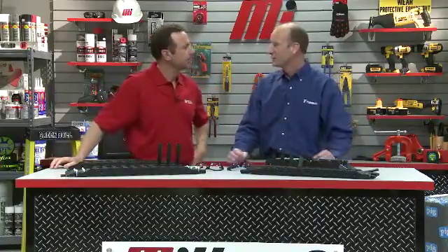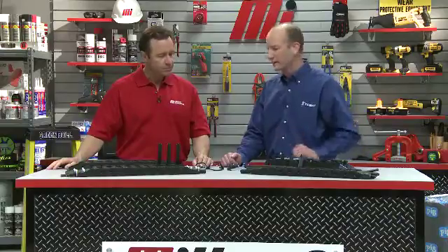Today we're going to be discussing what steps we can take to improve the life of our cables and hoses operating inside a dynamic cable carrier. First, we need to ensure that the cables and hoses have been properly selected for this type of application. We often find that customers mistakenly install a static-style electrical cable or hose inside their cable carrier, not realizing that they need to use a continuous flex cable or hose for this type of constant motion.